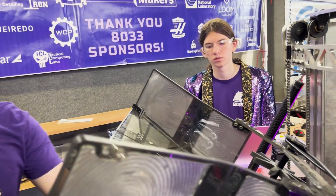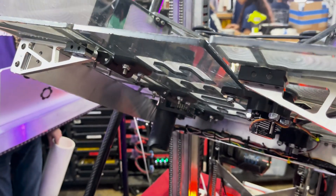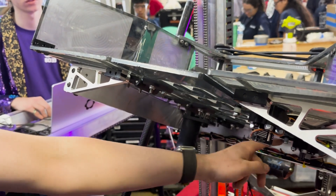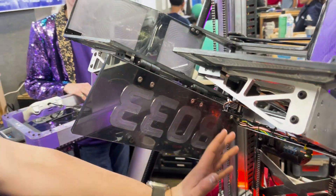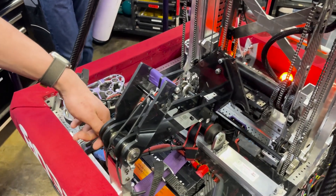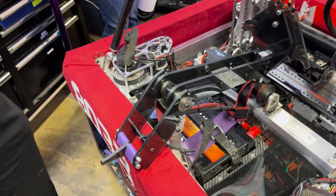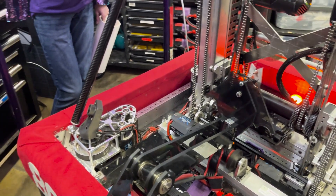When we're ready to climb, the chain has to go right through the funnel area, so we put two servos on the underside with little hooks that grab what we call the funnel trap door. The servos aren't doing a lot of work since the door is held closed pretty much passively. At the end of the match, the servos open the trap door to allow the chain through — the cage actually goes under the robot. When we deploy the climb, a cam pushes this bolt down, causing the foot to go down. The foot is just long enough to hold the cage far enough out to clear the funnel, the chain goes through the middle, and this locks in — that is our deep climb. It's about as simple as it could be, and we like that because it's light.